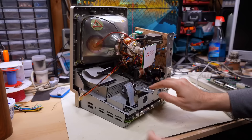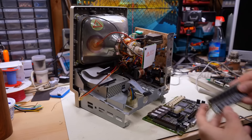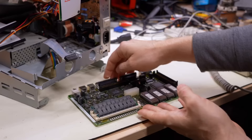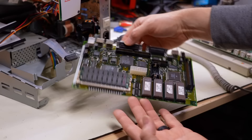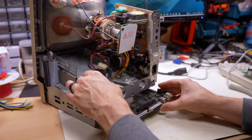So let's do a little further testing on this thing and see if it's actually fully functional. I could be greedy and put some RAM in this - I think we only have two megs of RAM on board right now. The original RAM that was in this is only one megabyte, so this thing only had a total of four megabytes. Why don't we try to upgrade this thing all the way to its max 10 megabytes? Here are a pair of four-megabyte SIMMs. Now these are the parity type, and I'm not totally sure if these will work okay in here. Let's put it in the actual Classic II chassis instead of the Classic chassis, just to give it the full complete test. I don't love changing two things at once given how many random problems we've had, but let's just go for broke.